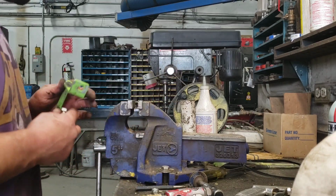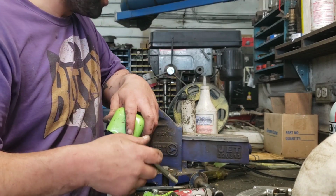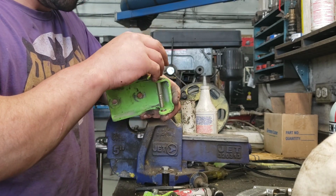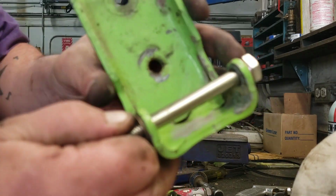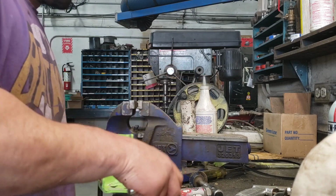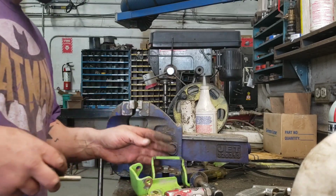But honestly, you put some grease, and we use grade 8 bolts for our pins and the brass bushings on our pulleys. You just spray them every time you service, and they ain't gonna wear out. But as you can see, you're not gonna pick up the little bit of movement on this camera, but there you go. I have to drill this out to the size of this. So I'll size that up.